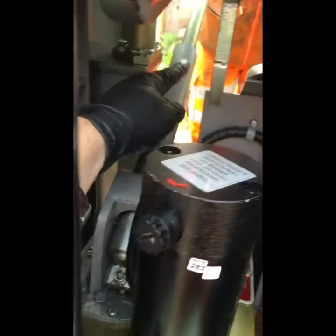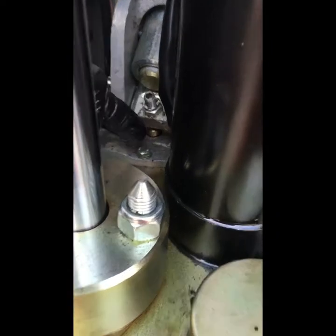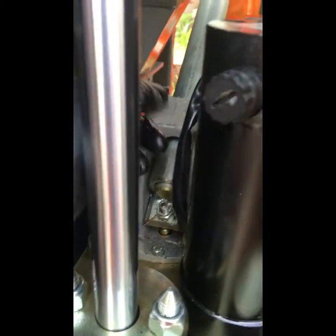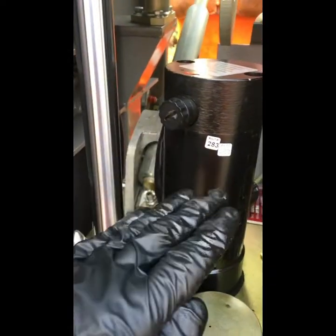On the back of the pump handle, when you lift the pump handle out, the main shaft of the pump handle lets this little armature up, which breaks this small piston down here, releasing that valve and allowing the barriers to drop. So as soon as you pull the pump handle out the barriers will start to drop — that's what you've got to be careful of. You can control them down by allowing the pump handle in slowly, so in and out will allow it to drop slowly.